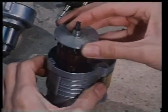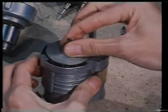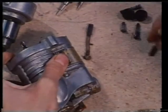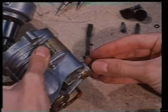After checking and cleaning, replace the armature, ensuring that no damage is done to the windings. Check the brushes for length. Ensure that brushes are correctly bedded onto the commutator surface. A short brush will have insufficient spring pressure, resulting in bad contact or uneven wear on the commutator.